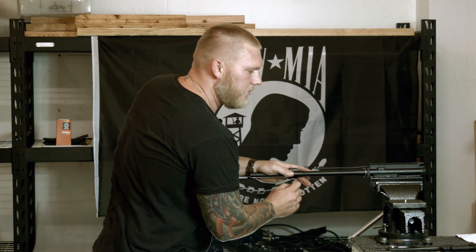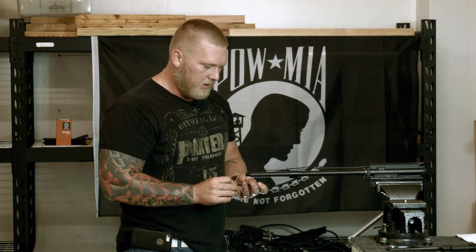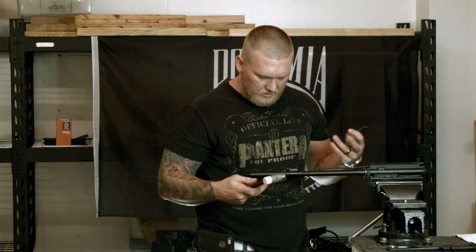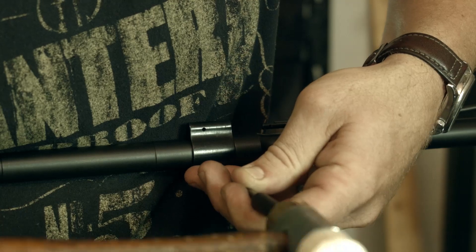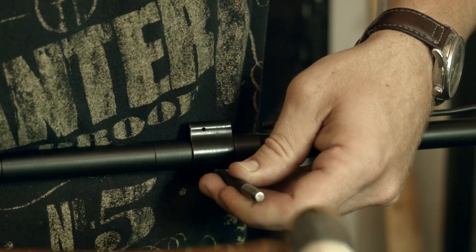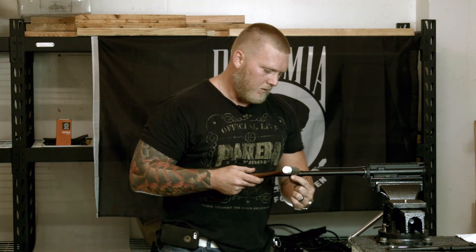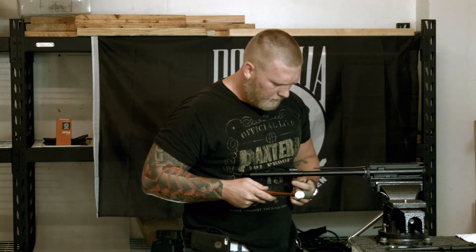Now I'm going to go through driving in your roll pin. Remember on the other video — let's talk about bracing the barrel. Anytime you're starting to beat on it, don't stand out here and start beating on it. You've got to brace it. The set screws are holding it in place and I'm just going to put my body against the barrel so my body's taking all the shock. Now I'm going to take my flat punch and split the difference. I'm feeling it there. Take a look underneath — try to go a little more.